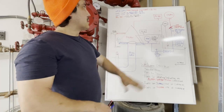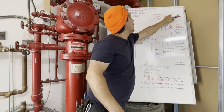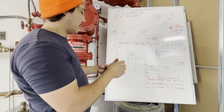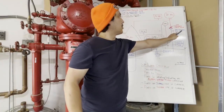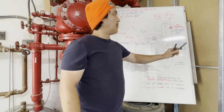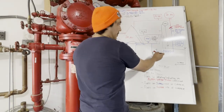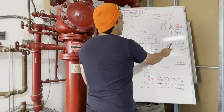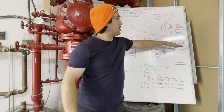In the event that my system is losing pressure — say, for example, a head went off and I've done all my repairs — let's say we've got 70 PSI and 70 PSI equalized at 70. What I'm going to do is very simple. I will open my excess pressure pump discharge shutoff valve, which is normally closed. I will open my excess pressure pump supply shutoff valve, which is normally closed. I'm going to turn my pump on. It's going to suck city water supply pressure of 70 pounds and pump it downstream. That check valve is where all the magic happens — that is what's going to lock in the downstream pressure and raise it up.